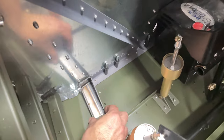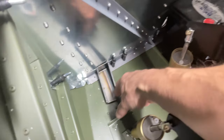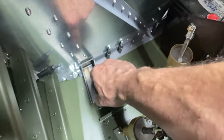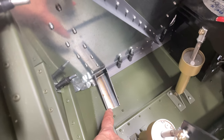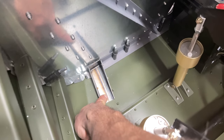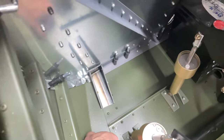So we're going to get that lined up, get that center hole marked, and get one hole drilled in the correct location. We have to make sure this is mounted right up against here, line everything up, and then I'm going to mark it on the inside from underneath with a marker so I can get that first one in there, and then back drill the other two from that point.